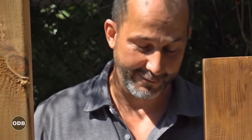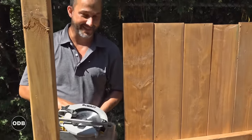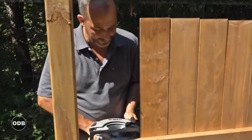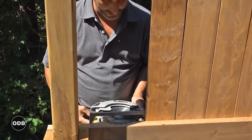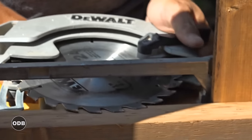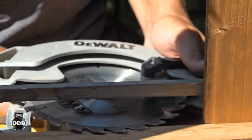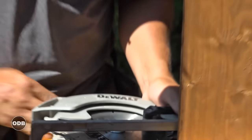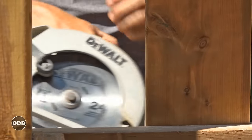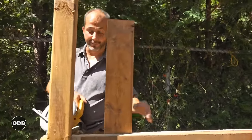This is a little bit of fun for those at home who are comfortable using a skill saw. You need to set the depth of your blade so you're comfortable to cut without overcutting. All we're going to do is visually keep an eye on the blade, make sure it's on top of the rim joist, and just run this along so these boards topple over out of the way. We demonstrated how to cut down the skirt board with the skill saw — we'll do it again. Basically you've got to get the guard out of the way. If you're not comfortable using this kind of tool, then don't do this. Rest that blade on the rim joist, start it up and off you go.